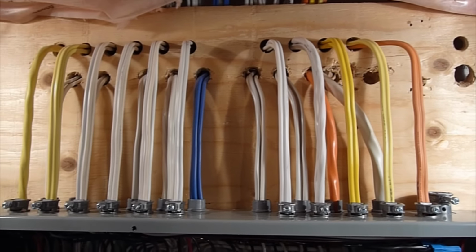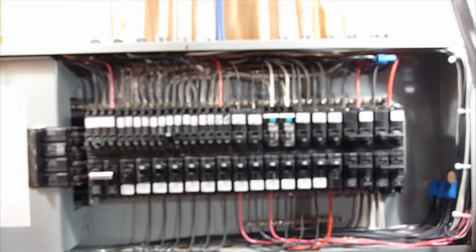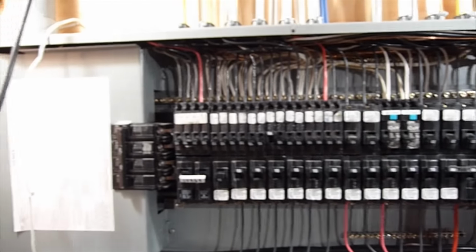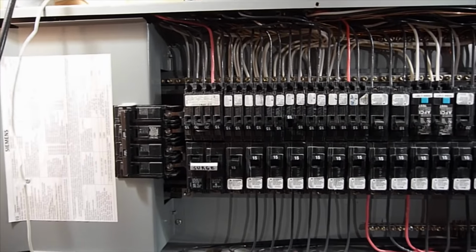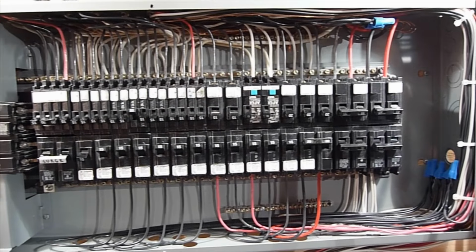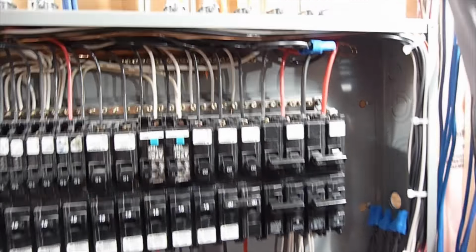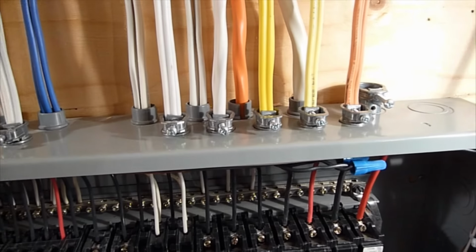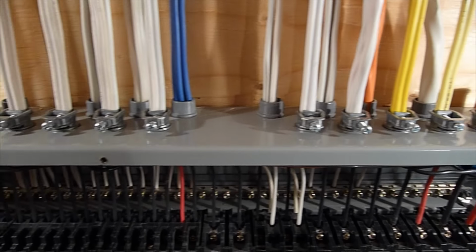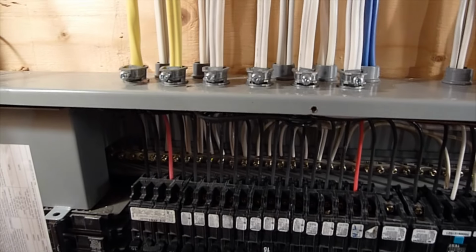It's organized. It's logical. There's this extra wire here, the 100 amp service wire for the workshop. I have to put that in, and I'll tie that in later into the panel. But in terms of inside the panel, you can see how all the wires now are nice and straight and organized. It's almost too straight, but you know what? It's nice to have that when everything is organized inside the panel. Nice to look at. I have the proper wire connectors here now, the L16s clamping the wires into the panel. Easy to take out, easy to change, easy to move.